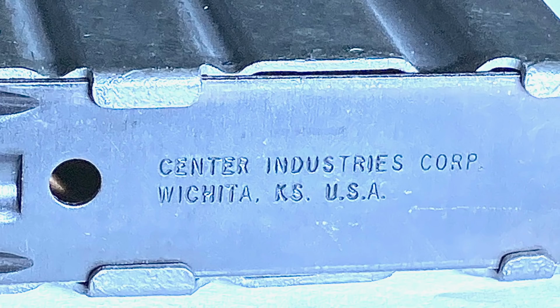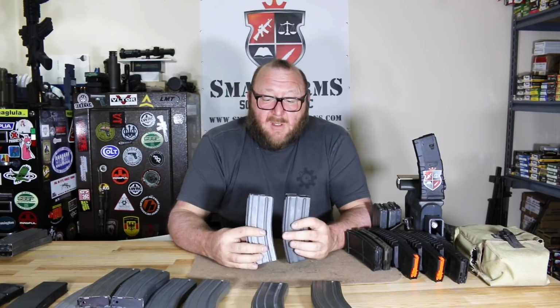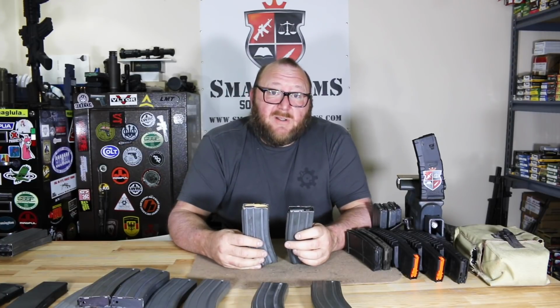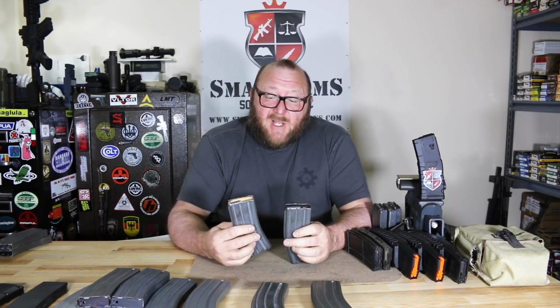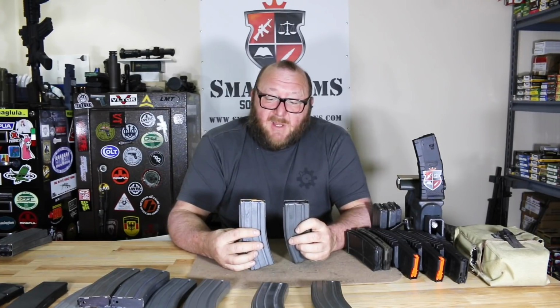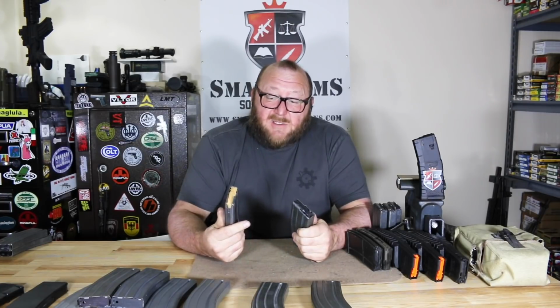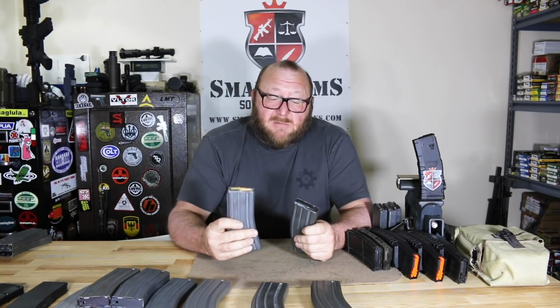Now, Center Industries goes way back, again from the black follower to the modern-day tan followers. Now, the tan follower magazines, as we discussed earlier on, I had found a problem with those when I worked at Colt. I was notified by a friend of mine at Fort Drum. They were getting ready to deploy, and they had just gotten cases of these in, and they were having failures to feed with the M4s and the M16A4s. And he had contacted me at Colt to see if I knew anything about it, and I had gotten these in to test, and we found out that there were design problems with these.